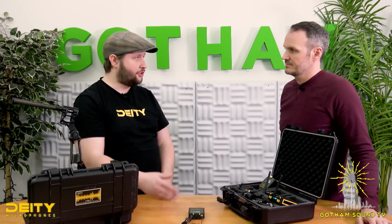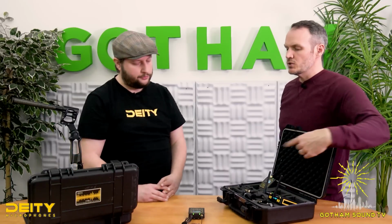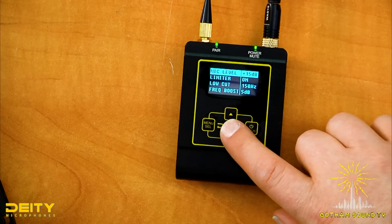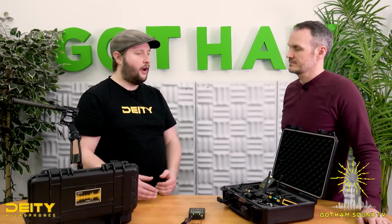Again, with that lossless stream technology of the retransmissions, you really get a nice, full, rich, original from what your lavalier was producing. So you're transmitting at the same thing that most people are recording at, so you're not losing anything. Yeah, absolutely. And that's why we wanted to put the analog limiters at the transmitter, because so many recorders now don't have analog limiters, the Tascams, the Zooms, all that kind of stuff. And we wanted that at the head of where it's actually being acquired.